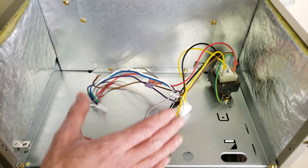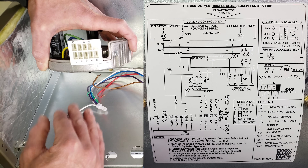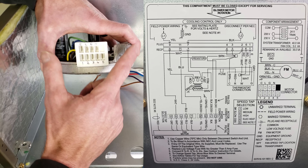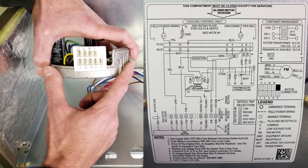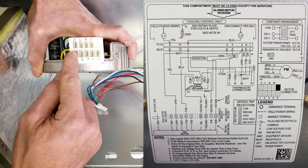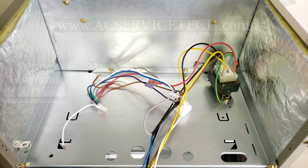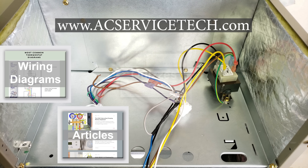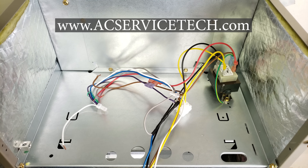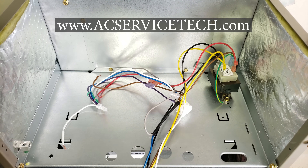I'm going to give you a wiring diagram for this wiring of the air handler that we just went over. The whole point of this is that some of these air handlers are now not equipped with control boards. In fact, the only control board on the entire air handler is found on the end of the motor — it's called the motor module — and that's on these multi-speed ECM blower motors. Basically you're just designating the blower speed on the taps down here. If you want to learn more about thermostat wiring or check out articles, quizzes, calculators, and the podcast, make sure you check out our website over at acservicetech.com. We also have other videos on air handlers down in the description section below. Hope you enjoyed yourself — we'll see you next time at AC Service Tech Channel.